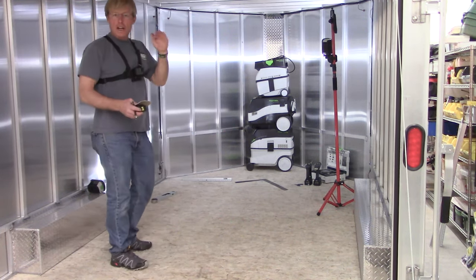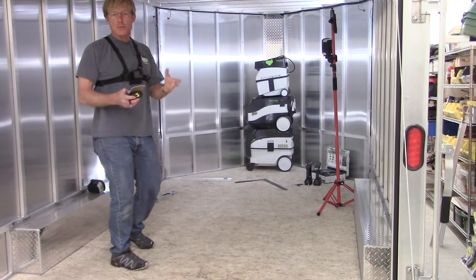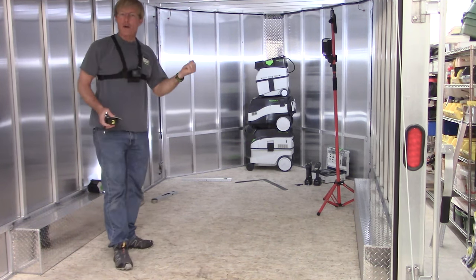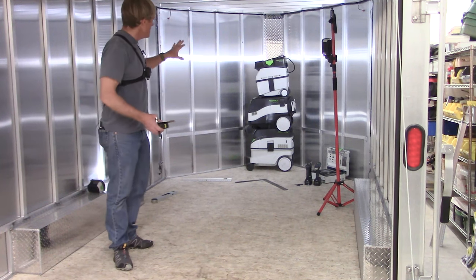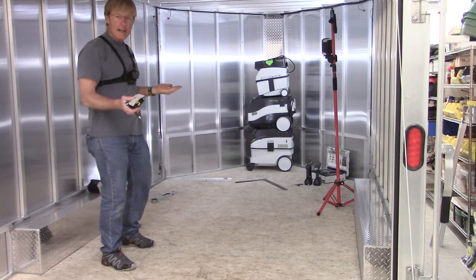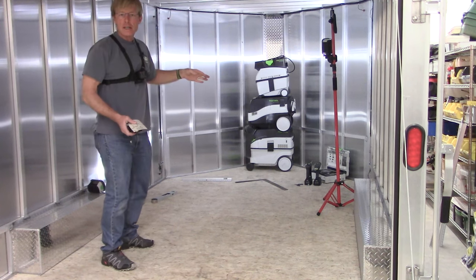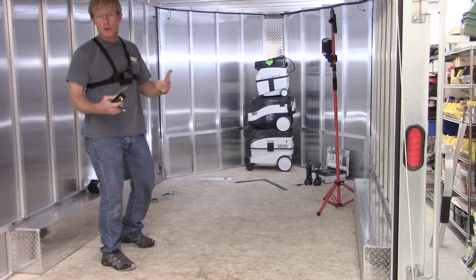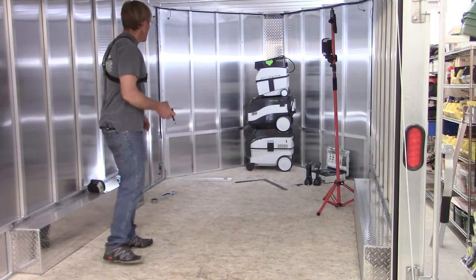The shelves are not going to be readily adjustable. I'm going to put them in with pocket screws and they're not going to pull out like the last one did — I just need fixed shelves. I'll do them with pocket screws, probably three or four on each side. That way if I need to make an adjustment, I can take the vacuum out, pull the pocket screws, and move it up or down.